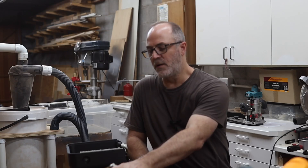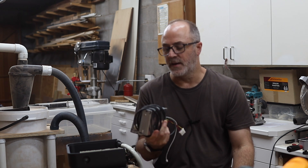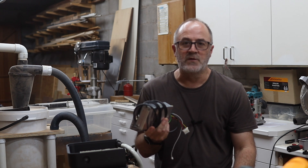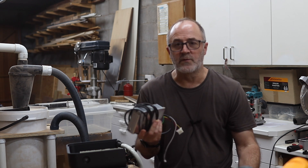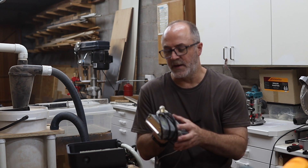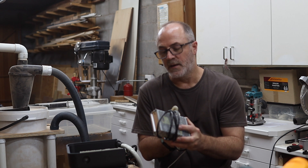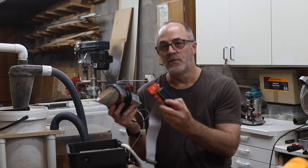This is all going to be powered by a switchmode power supply. In the other video I did try to make a power supply of my own but it was unsuccessful. I'm no electronics expert — I know enough to get by, which is very different from building something like a speaker crossover. This is a 12V and 5V output switchmode power supply, which is what's required by both the CD-ROM drive and the controller board.